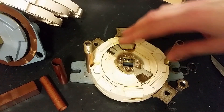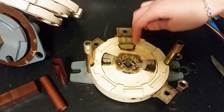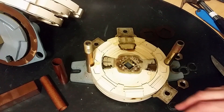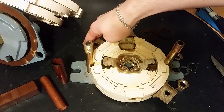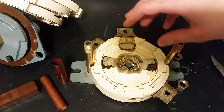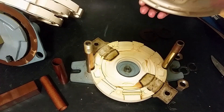It's easier to look at it this way. This is the output on top, that's why it has two brushes. You've got one off position, then one to terminal one; one off position and one to terminal two. So if you want power from one source — for example, two battery packs — you connect to that battery source using this one.